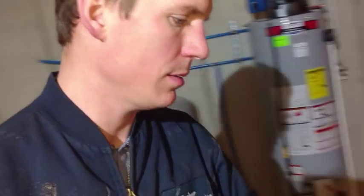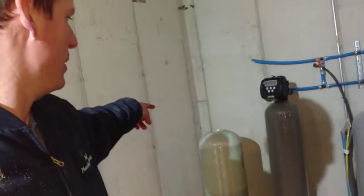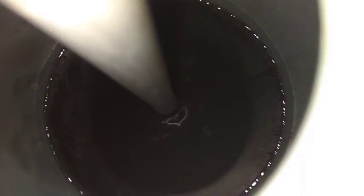Okay, just as a quick update. Basically, you got to prep the softener valves. Or excuse me. In this case, specifically speaking, we're focusing on the iron removal. Excuse me, the sulfur removal system right now. What I had to do right now is fill it up with water, at least to cover that catalytic carbon down there. So I have the carbon soaking.